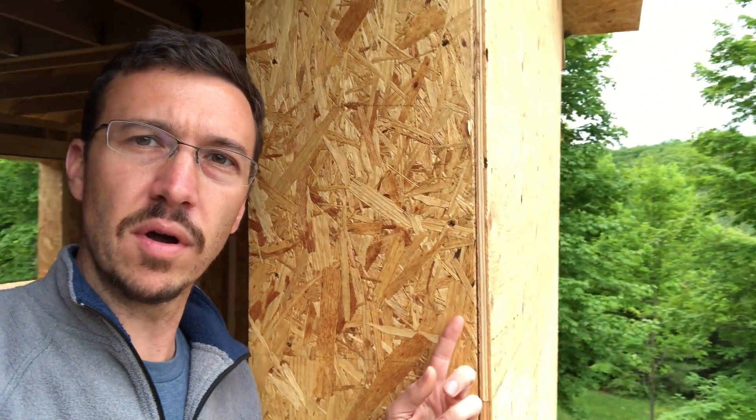The one thing I would caution you on: in my particular wall envelope I wasn't entirely sure where the wall would end up thickness-wise. I plumbed my walls from their base plate, so as I went up the building I kept the wall plumb, and in some cases this OSB was inside the outside sheathing and in some cases it was actually outside. I still have to trim some of this window bucking. I prefer that my window flashing mounts to the sheathing. Either hold your OSB in a half inch and let your outside sheathing come over it, or do it the other way — just take note of that with the window bucks. Up next I'm going to show you building these outside walls. Thanks for watching.